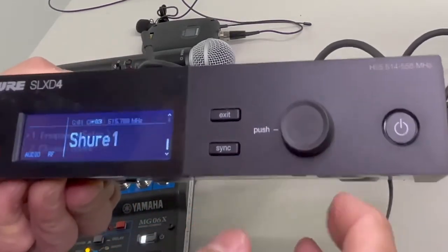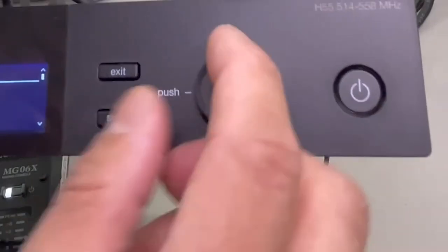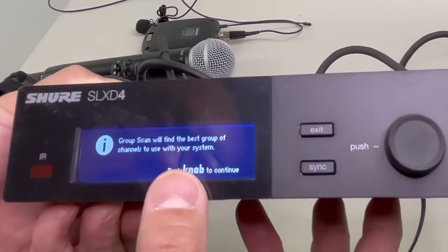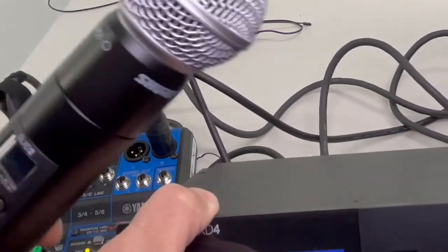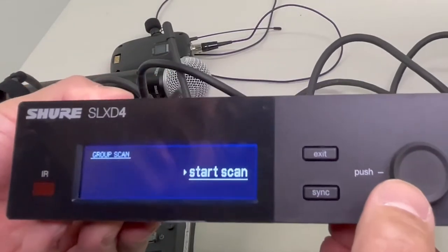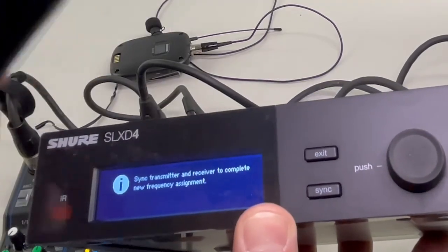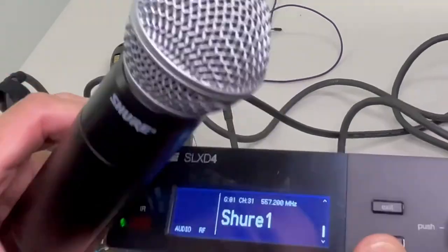To go into the actual menu, you just hit your knob — very sturdy, very nice, really hard metal. You hit frequency setup, then guided frequency setup, initialize the system, and it's going to group scan. When it group scans, just push the knob and it's going to ask you to turn off all transmitters. Make sure your mic and your lav pack are off. Then hit the knob to start the scan, hit assign, and it's assigned to the receivers. Now it is time to sync — cut your mic on, hit sync, and use your IR scanner to scan it. Perfect.